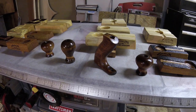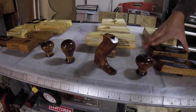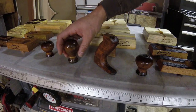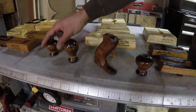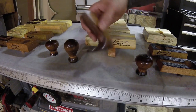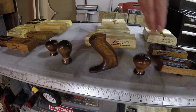Quick follow-up: I was working on the hand planes and also on some cigar rests where I've done the burning technique, and I'm applying the final coats of shellac. Usually I'm pretty heavy-handed with the knobs — I just dump them in the shellac — which gives you a pretty heavy, coarse finish. But this time since I was already spraying other things with shellac, I decided to spray the knobs too. These have two coats on them already and I'm about to apply the third and final coat to both the knobs and the tote.